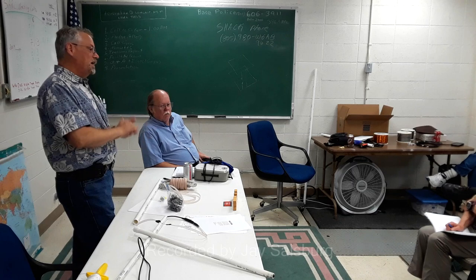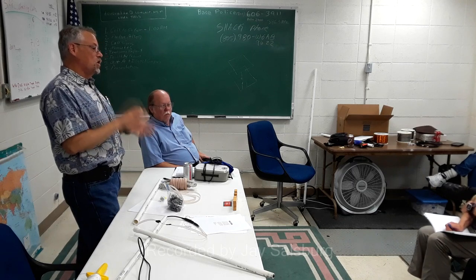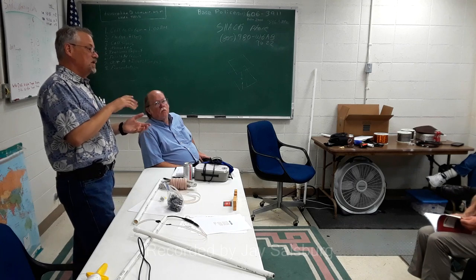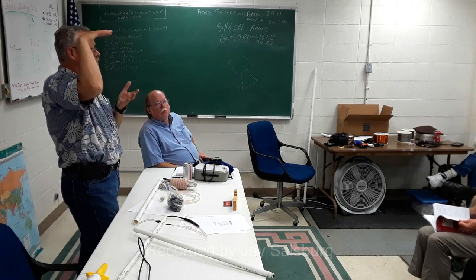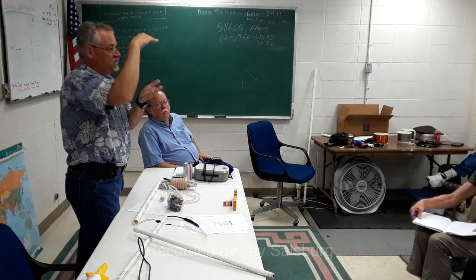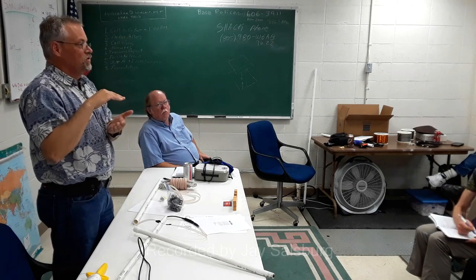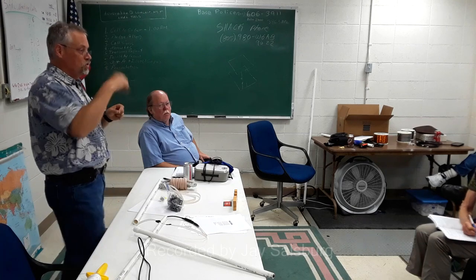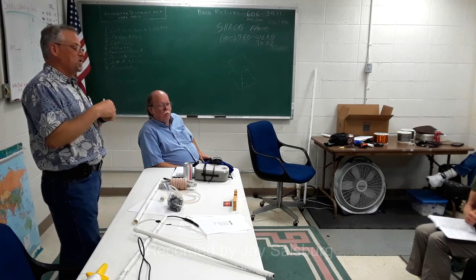All right, all of that to the side. The way I do it is I use a charge controller. Because what that does is it will ramp up, do a bulk charge, and when it gets to a certain percentage, it then drops into the trickle charge and maintains the battery. That's going to be your most reliable approach and healthiest for the battery. The little trickle chargers do trickle, but they're not smart.